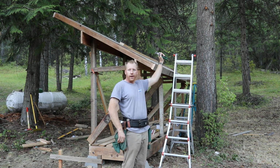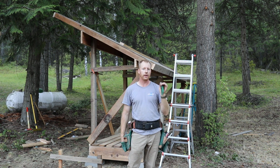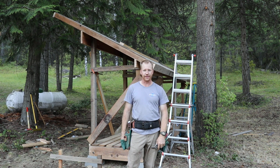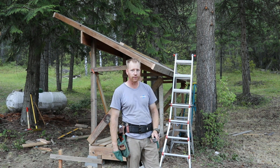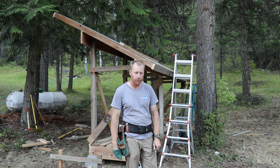The roof sheeting is nailed off. We did approximately a 6 and 12 nailing pattern, 8-penny nails, hand-driven. Put a couple chicken boards up there just to hang on to while we were doing it. It's a small roof, so there's not a lot of room to right yourself if you start going over.